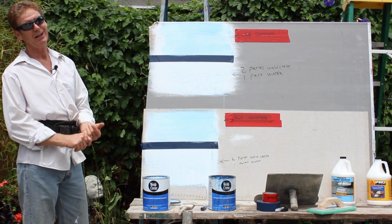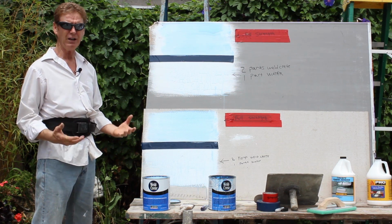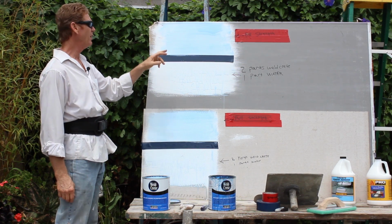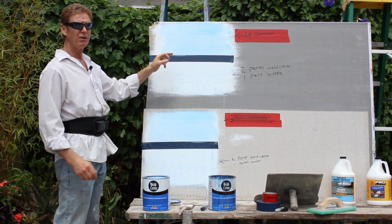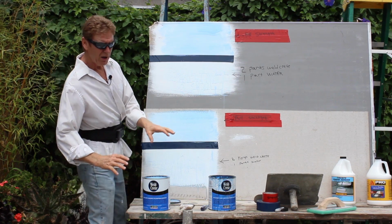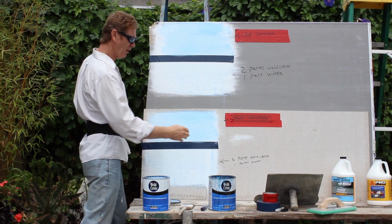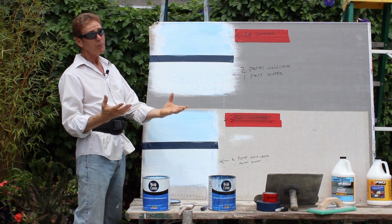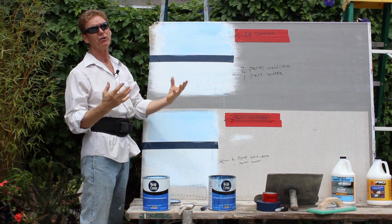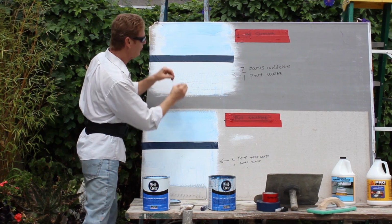And I said, man, you put it on so thick that if we would apply a 1/2 inch or 1 inch, it would adhere. But now you sealed it because you had a great painted surface and you put a sealer on it. So when I apply a color coat, again, it's got nothing to do with any bonding agents. When I apply a color coat, it can't suck up to the wall. It's got to have some absorption. If it doesn't have the absorption, then it'll dry by the outside air. And when the outside air dries it, which will take a long time, it'll spider crack or spider check.